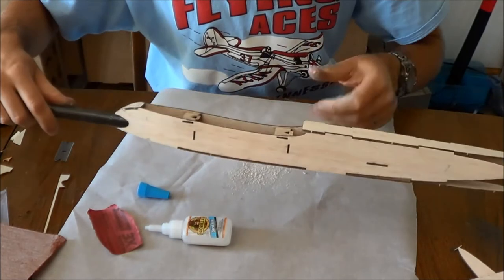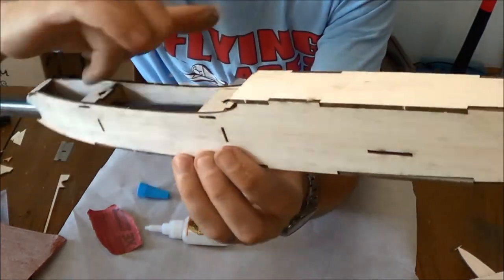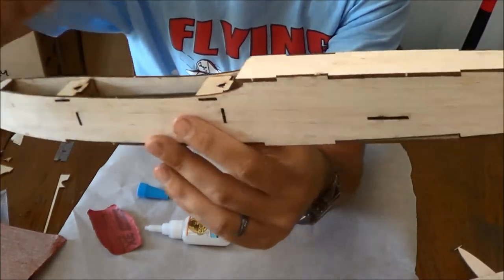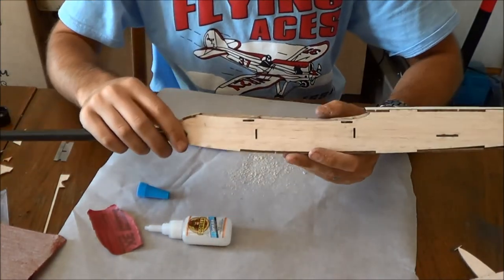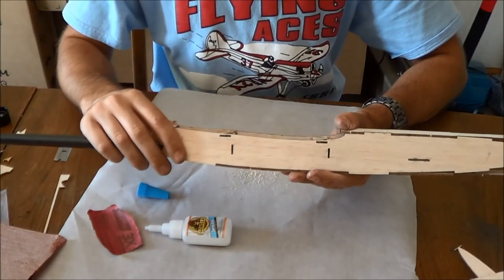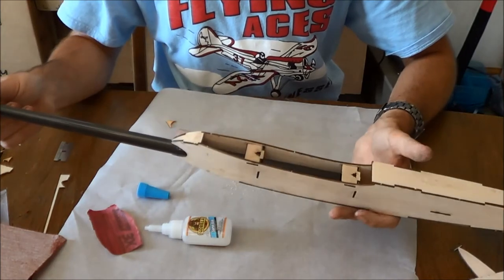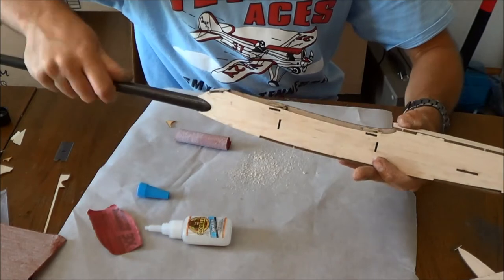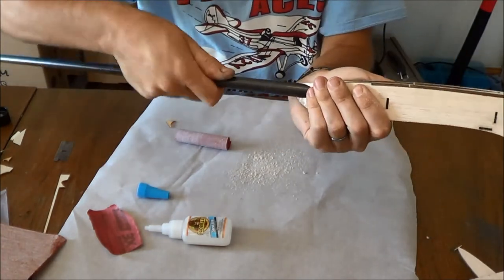So at this point, the tail boom slides all the way in. Now, I don't know if you can see, but there's a slight lip up here of the tail boom sticking forward about 3/32 of an inch. That is about the amount that you want so that you can get a good secure mount. You don't need any further than that. Now what we're going to do is...